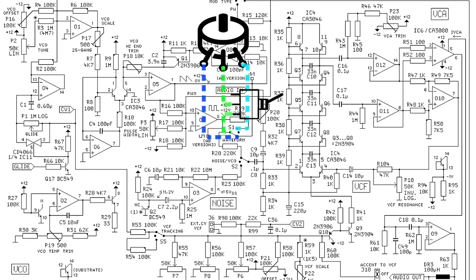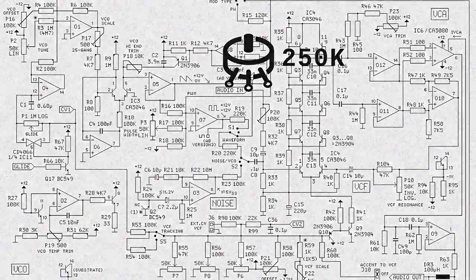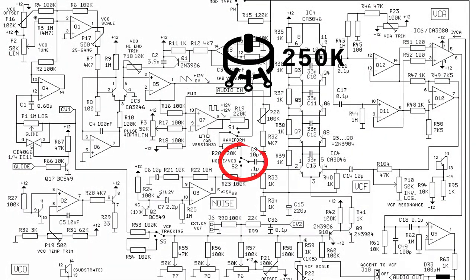Turning the knob now blends between both waveforms, coming in from the outer pins and going out to the middle pin. Flipping the switch, whose other outer pin is wired to ground to avoid signals bleeding into the circuit in the off position, completely disables the VCO output. A second 250k potentiometer is used in a similar way to make it possible to mix some noise into the signal path after VCO. This time I will tap into the switch that toggles between noise, VCO and external in.